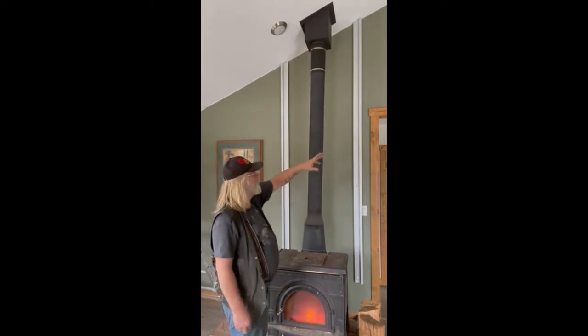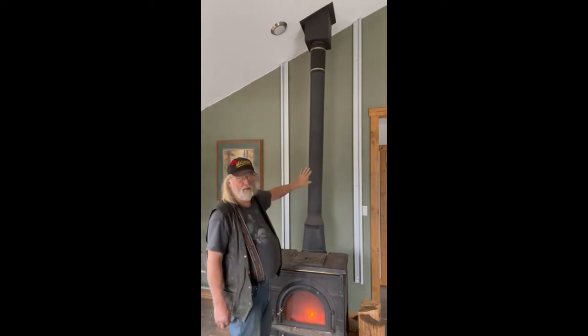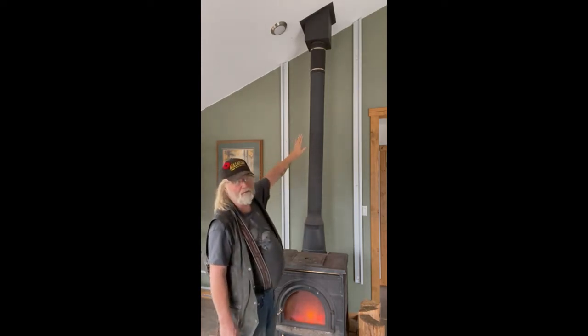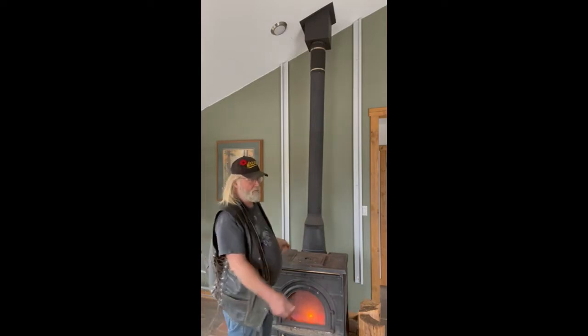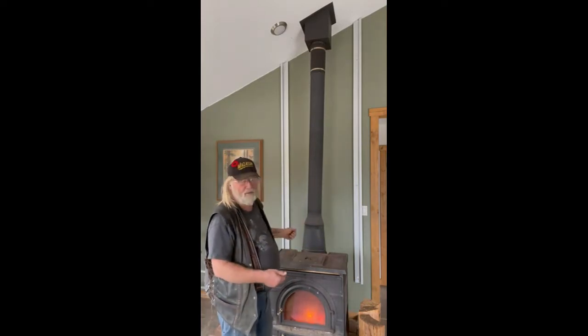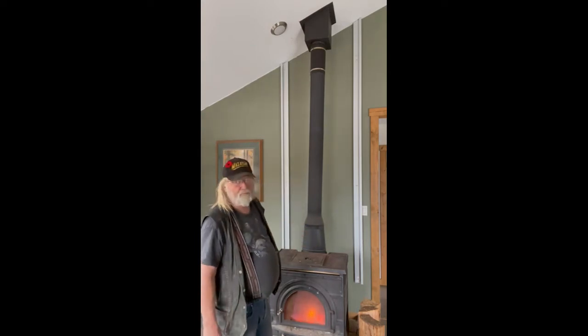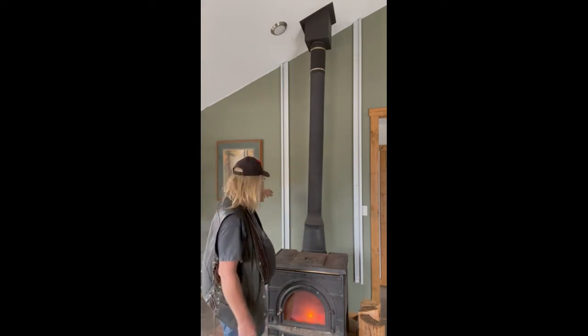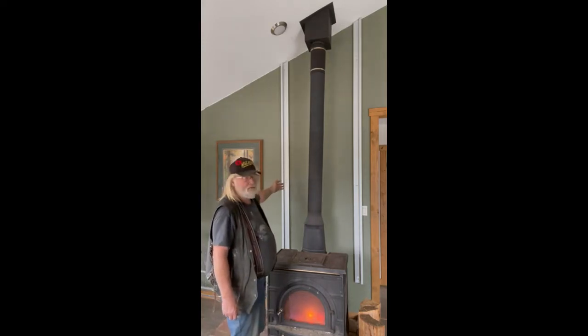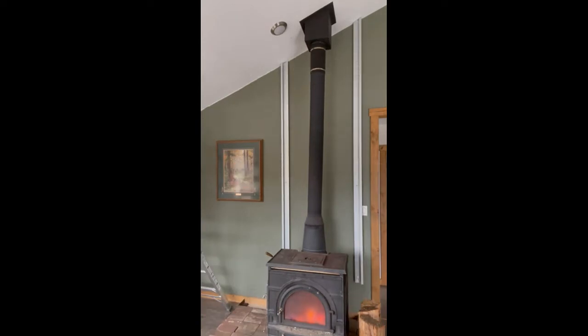Then we'll slide that paneling in behind here and just tuck it in and bend it in, and it'll slide up and lock into the top J mold. And then I'll lift up the bottom one and screw it down, so the weight of the paneling will be held by the bottom J mold. You're just holding it up, and these side molds are basically to keep it away from the wall and whatnot.